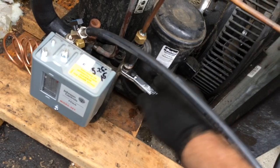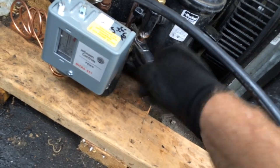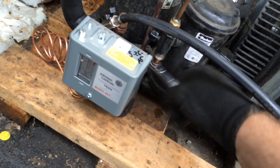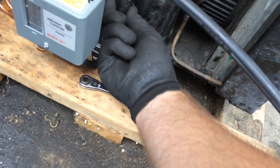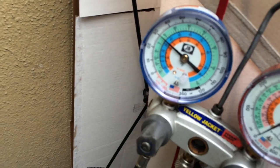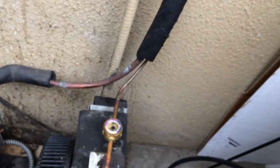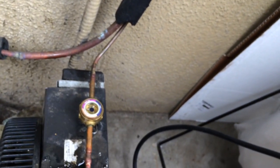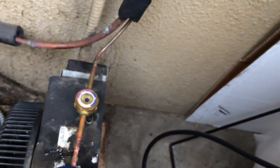There we go. We'll run for a minute here — the box is hot. We'll see if the sight glass clears up; we might have to add a little charge, sometimes you do, sometimes you don't. We'll let it pull down, I'll go make sure those guys got the door closed and all that. Suction pressure outside is about 28 — that's about a 30-degree evaporator, which is about right because the box is hot. I think the box is at 48 degrees. Let me jump in there and get gauged up inside at the evap coil.